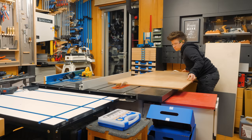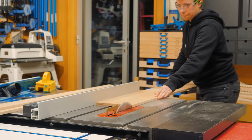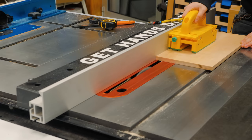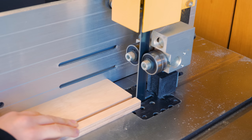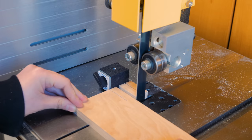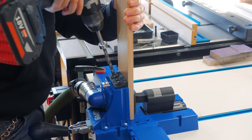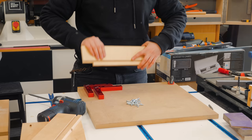Here I was cutting all the wood for the drawer boxes — making three boxes, one of them being taller than the other two. I'm using pre-finished birch plywood again, since I hate finishing the interior of drawers. The bottoms will be made out of 6mm plywood, so I made two passes on the table saw to create a groove on all drawer sides. The back pieces need to receive two notches in order for the drawer slides to fit. I put these together with pocket holes since it's quick, easy, and gives a very clean look when the false front gets installed.